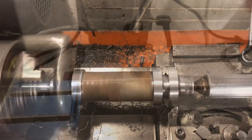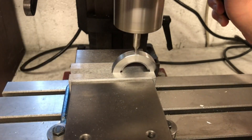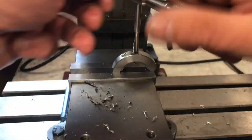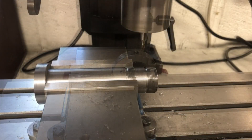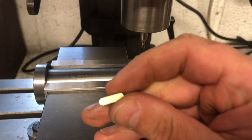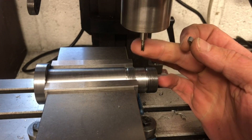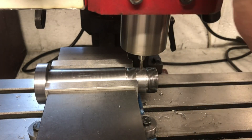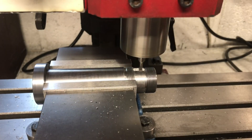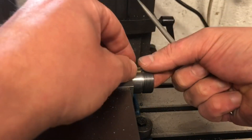So it's over to the mill. Only a couple of features left to complete today. The nuts need a cross hole drilling and tapping for a grub screw. These will lock the end play adjustment once it's been set, and the screws will be backed up by copper pads to prevent damage in those threads. And finally, the spindle needs a keyway. The key is supplied as 4mm keystock — I don't have a 4mm cutter, so I'm going to have to open out this slot with a 1/8th slot drill until I get a nice fit. That's done and I'm happy with the fit.